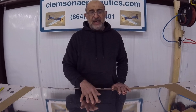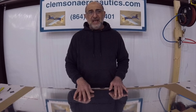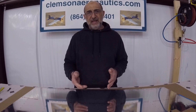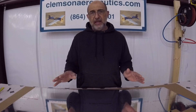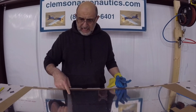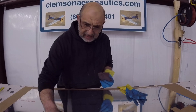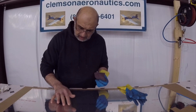I don't think it's a good idea to use a deburring tool on this. The skin is only 16 thousandths of an inch thick. If I go just a tiny bit heavy on that, it will enlarge the hole. And if it doesn't, at least it's going to make the skin very thin inside the wall of that hole. So I'm just going to use the scotch brite to make sure the hole is deburred. You can probably see this one line that I deburred with my scotch brite — it really does seem like it did a good job.